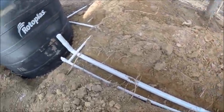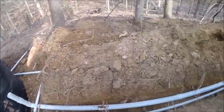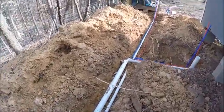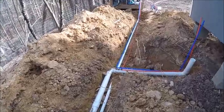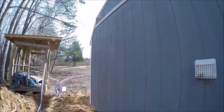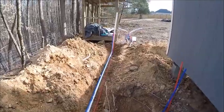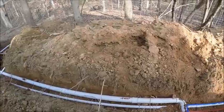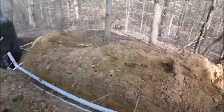I've got a four-inch line stubbed up. I don't have my gutters on yet, so when I get that taken care of, I'll have the stub there and I'll be buried and ready to go. So what we have here is the 90 for the four-inch pipe — it's going to come up and I'm going to connect it to the house, connect the gutters, and tee them in. Down there you can see my hot and cold PEX ready to go, stubbed up. I'm going to go ahead and bury that and move on to the next phase.